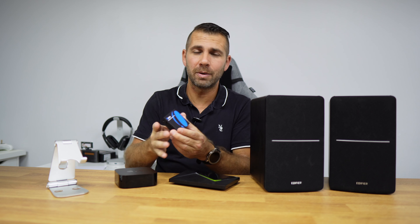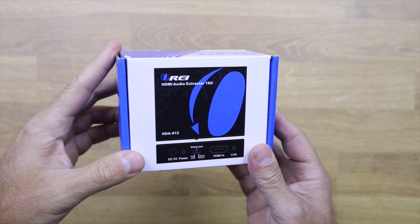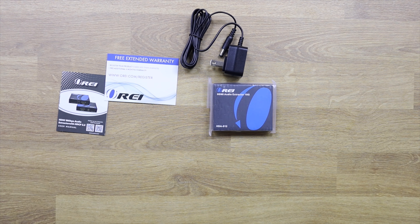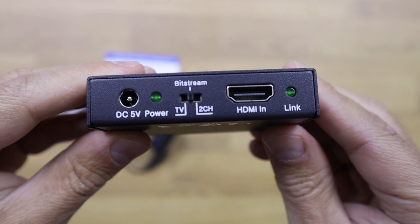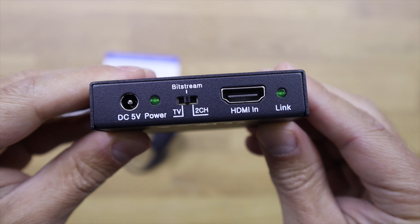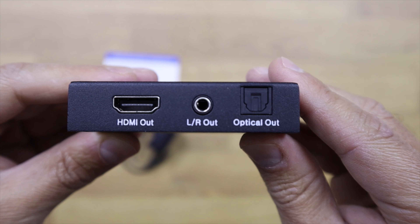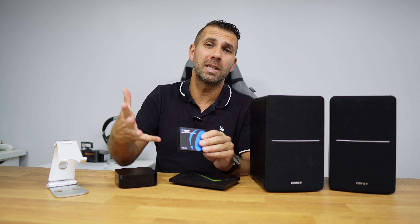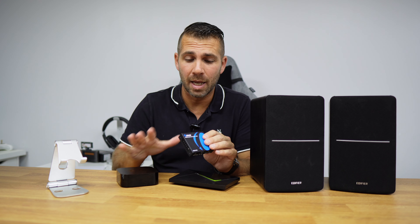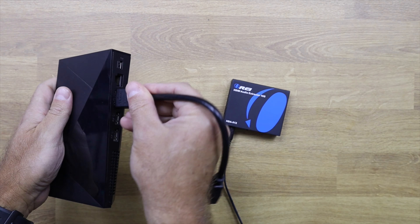Keep in mind that not all audio extractors do the same job. I'll post the formats this one supports — it's one of the best I've found so far. It supports video and audio pass-through, so we can transmit whatever audio the device outputs without degrading the image signal. Some extractors on the market will compress both audio and image, which is not good. In this case we get a real pass-through: whatever comes in goes out, up to 4K at 60Hz, 10-bit video, and all the formats mentioned.